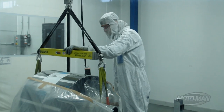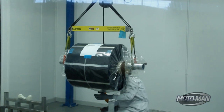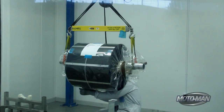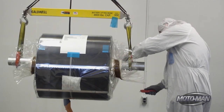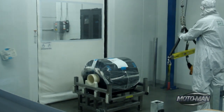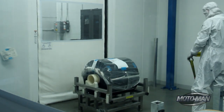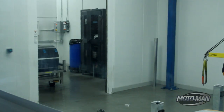The most basic building block or root level of a battery is the electrode. This is the part that conducts either the positive or negative polarity, called anode and cathode. They don't arrive at the factory sized to the application. Instead, much like body panels, they arrive as a mother roll that's cut into smaller rolls or sheets, which are then processed and dried at very high temperatures.